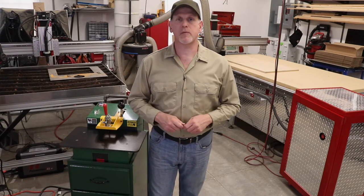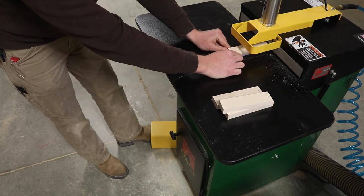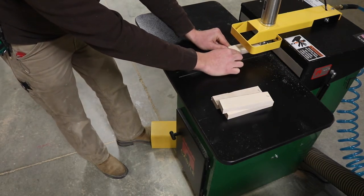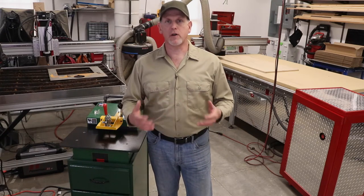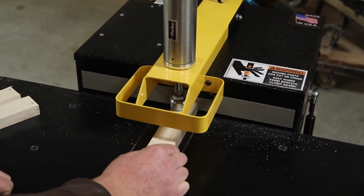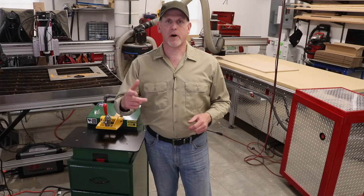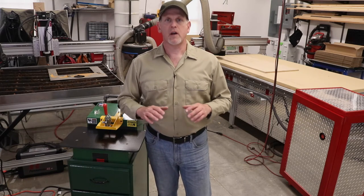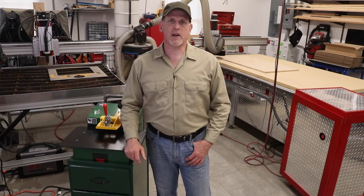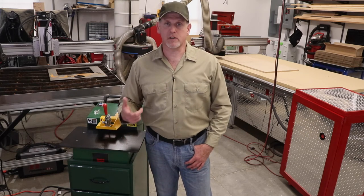Cutting pockets on the TSM-22 couldn't be any easier. You simply insert the work piece into the throat of the machine, hit a foot switch, and that fires a piston that comes down and secures the work piece and lifts the cutter head into the material. A drill also enters the material and drills a pilot hole for the screw. Within a second, you end up with a beautiful, elegant, professional pocket — a pocket you can be proud of. You actually spend more time lining up the work piece than you do firing the machine. We went really slow because we were getting used to it, but I can see how over time you'd become really fast and efficient and crank out a huge number of parts in a short period of time.